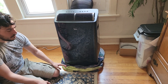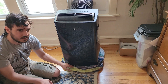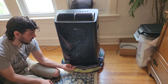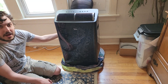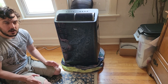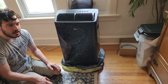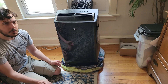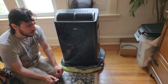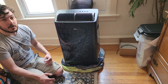One of the things I've already done to mitigate the hair issues is stuffing a blanket under the units, just to hopefully stop the pet hair from getting in there. There's also a vent in the back that I'm planning to put a 3D printed adapter on, and then on that adapter I'm going to put a wire mesh — it'll just keep the big hair out and keep the condenser coil down here nice and clean, because it's hard to clean.